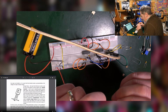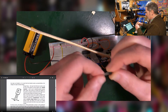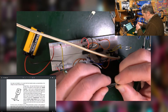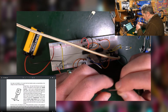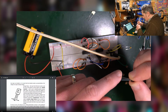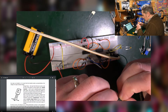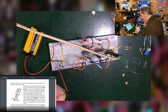Okay, got to connect the collector to the junction of the capacitor and diode. Yeah, well, the emitter needs to link directly to ground. So looking at it this way round, the flat front on it, the left-hand one is the collector, base, emitter. So the collector, what happens to the base? Right, I think I need to look at the layout below to understand how that's exactly going together.